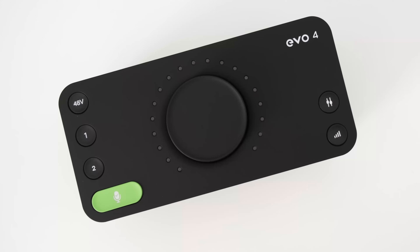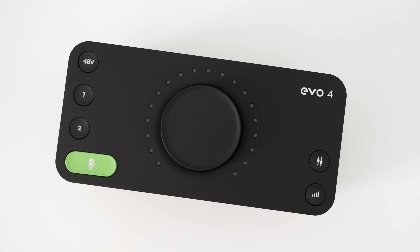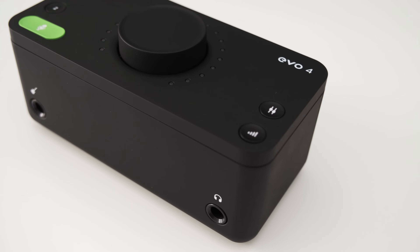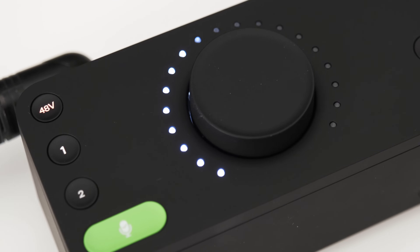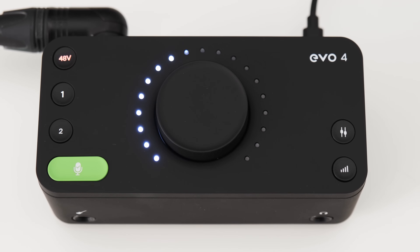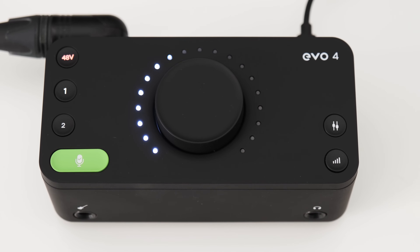So what's my verdict? The EVO 4 is a handy, very portable little interface. The multifunction rotary encoder works well, though it is less convenient to have just one dial instead of multiple dedicated controls. Audio recording and playback quality is excellent — low-noise preamps, high dynamic range, and low distortion on both inputs and outputs. I would have liked slightly higher maximum system gain for low-sensitivity dynamic mics, a lower headphone output impedance, and marginally better build quality. The smart gain feature works reliably, and while I still think you should learn to set gain manually, it's a handy feature if you're just starting out. All in all, for the money, the EVO 4 is a solid interface.